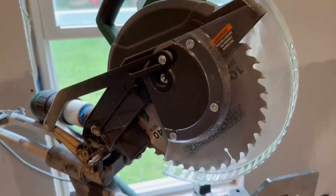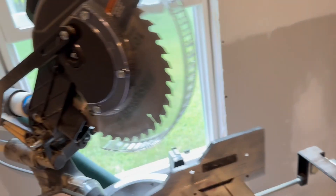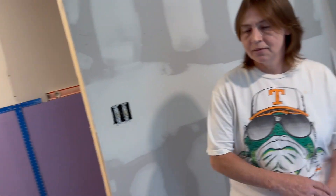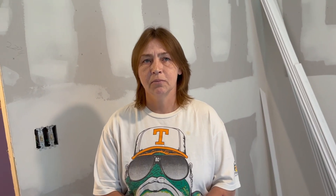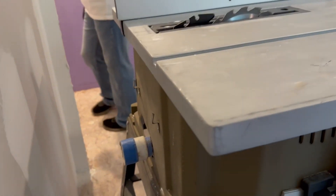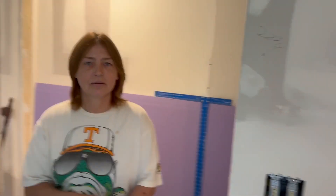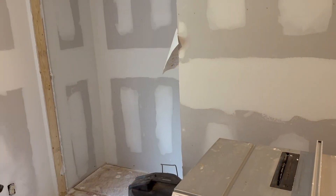Mary set up a really cool reducer here, because the vacuum hose is two inches and the outlet on the saw is an inch and a half. She took a plumbing pipe and some tape and did just that. So when we're using this, we hook up the vacuum and turn it on every time. This thing was cooking yesterday — I don't know how many cuts we made, literally hundreds. And then we had to rip everything down — all the jam pieces had to be ripped down from three and a half inches to three inches. This thing was going like crazy — it was even setting off the fire alarm.